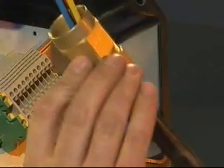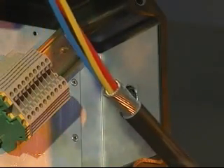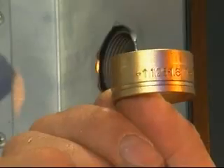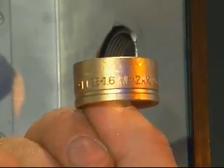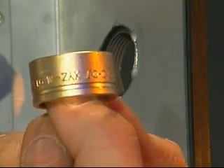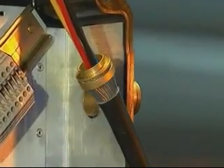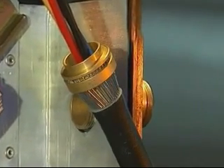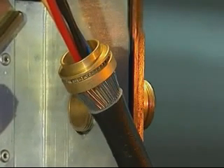Place the back nut, middle nut and the reversible armour clamp or RAC over the cable, making sure that the ring for the ICG 653 Universal is in the correct orientation for the type of armour or braid being used. For the ICG 653 dedicated armour gland, the armour ring must be placed over the cable with the thickest part of the ring towards the back of the cable gland.